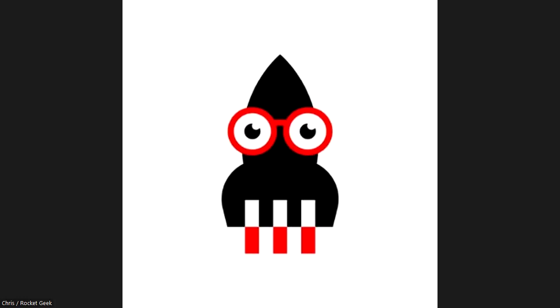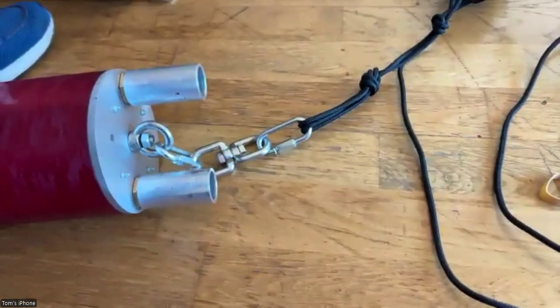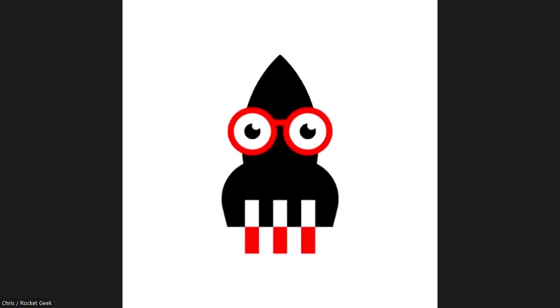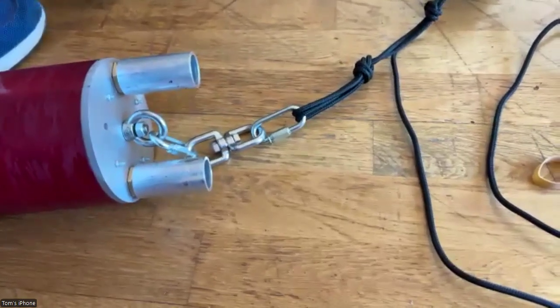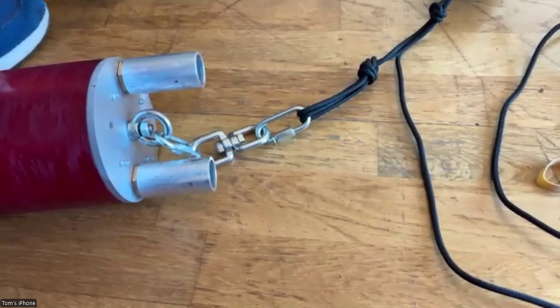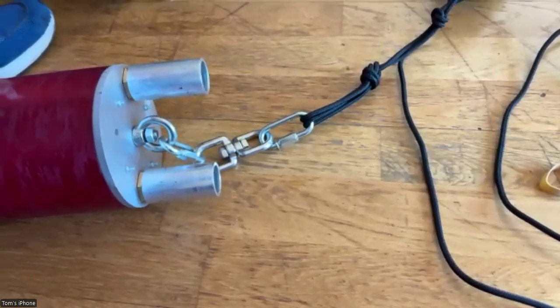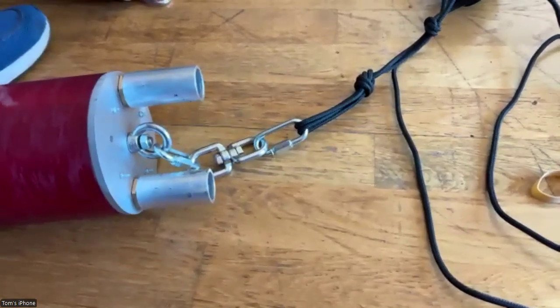What was the maximum speed you considered of your horizontal directional speed? For drogue deployment, sorry, or for main deployment? For the drogue. About 20 meters per second, about 2 seconds after apogee, sorry, which is more than what we expect anyway. Okay.